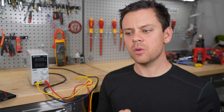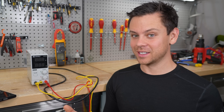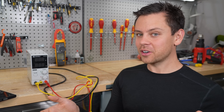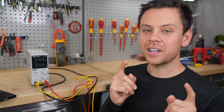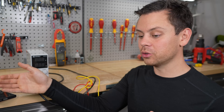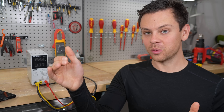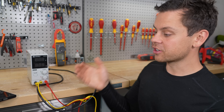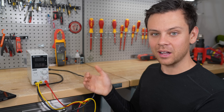Once your batteries are balanced, they will not go out of balance for a very long time. I used to run these cells without a BMS and bottom balance them — the voltage differential over time was not that bad. Sometimes I could last six months until I had to balance again. But it depends on how you use it. If you have high C-rate charge or discharge rates, or if one side of your battery bank is hotter than the other, you can get more cell drift over time. And if it's winter and you're not charging to 100% because you don't have that much solar, you're not balancing those cells. So I just tell people now: charge to 100%.